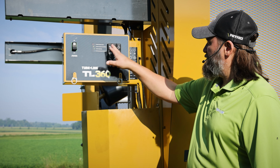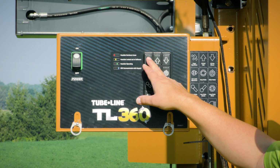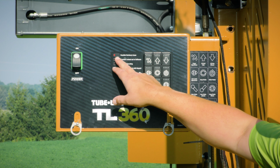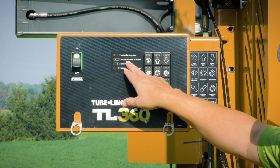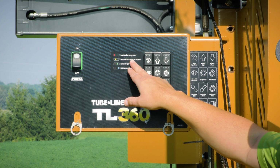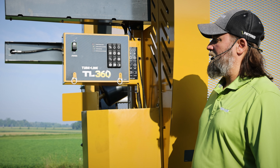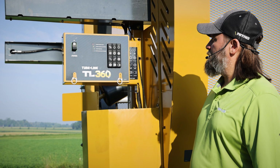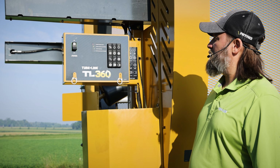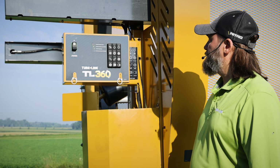One thing to remember is when you've got your lights on the actual buttons, and we kind of lay it out here of what it's actually doing. So if it's in yellow, it's locked out in the software. If it's red, it means you've got an issue. Could be a bad wire going to one of the coils, or it's definitely not communicating. So definitely have a look, find out where that break is happening.